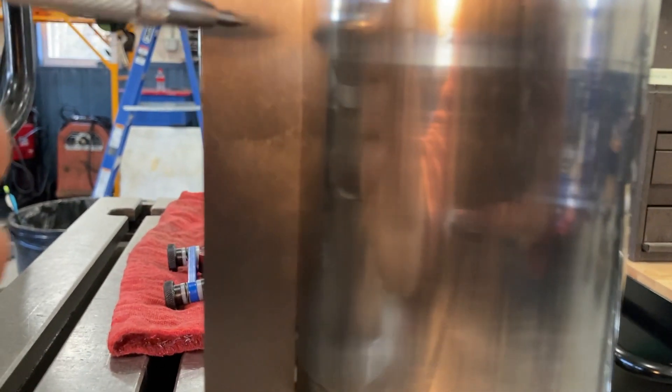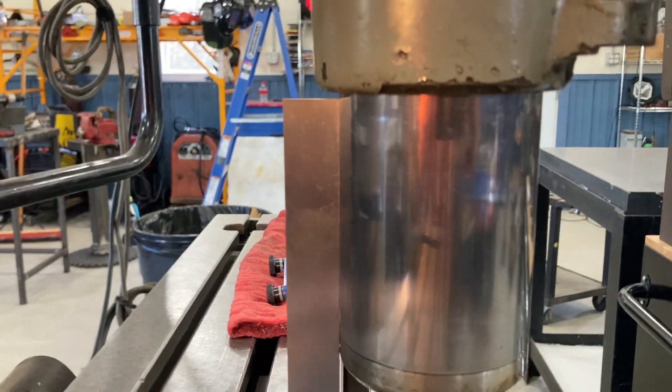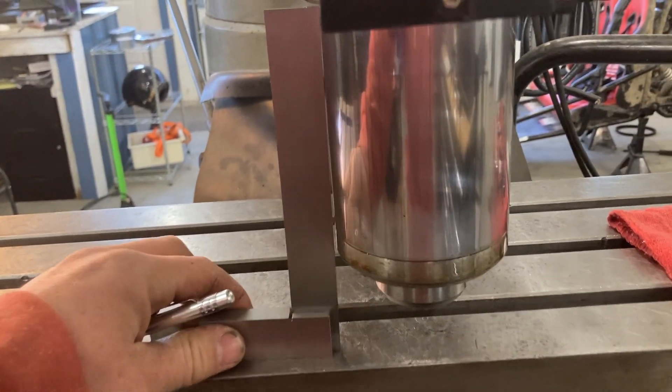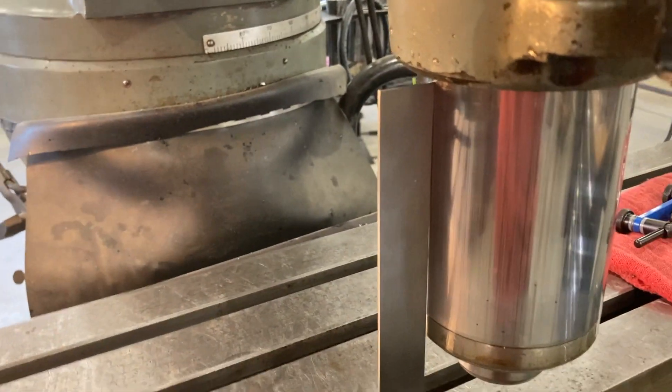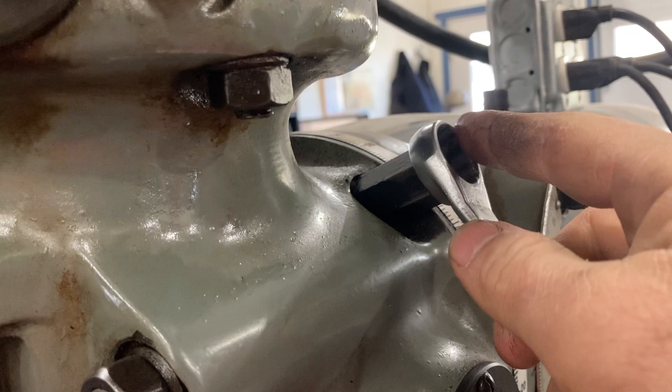You can see that I'm not seeing any light in here. I could put a flashlight or something on the table behind it just to get a better look, but I'm not going to finally tram it in using the square anyway, so I'm just bringing it in very close. Back here to the front, I can see the gap. So I'm going to reach up with my wrench and move this while I watch down by the square. It's getting closer — I am now very close.